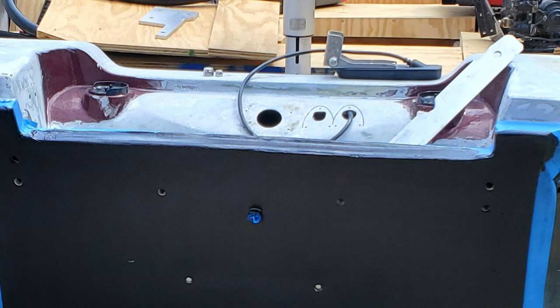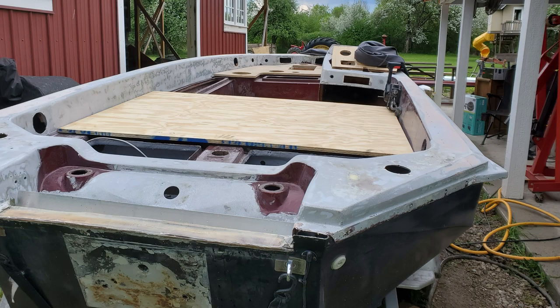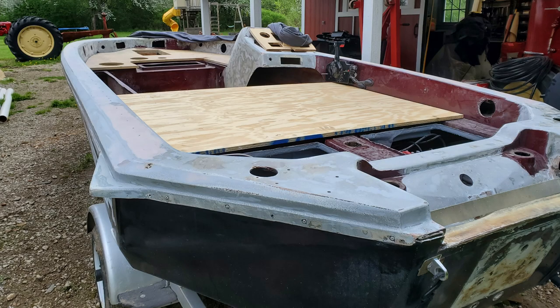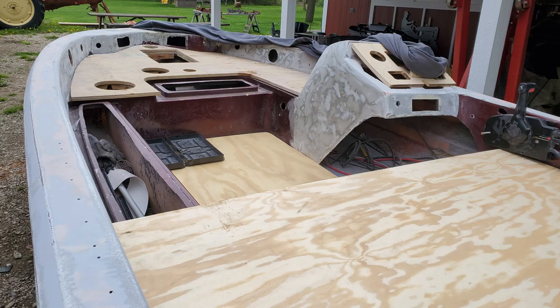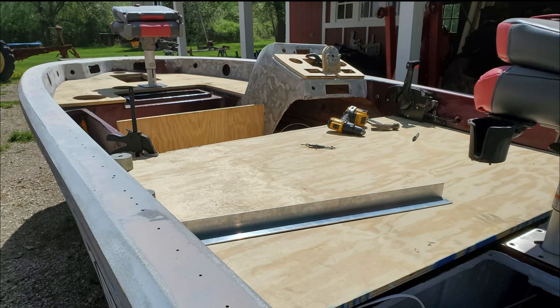I thought about converting those fill caps into bilge vents, but then I just decided to paint them and leave them in place. After lots of scraping and sanding, the topside was starting to clean up and I could continue progress with rough carpentry on the aft casting deck. A lot of old fiberglass boats had some pretty unorthodox hull layouts, and this one was a good example. The floor plan is disjointed and broken up into a series of poorly placed compartments, many of which are too oddly shaped to serve a useful function — the rod locker, for example, isn't even long enough to store a fishing pole. So I chose to build up a large continuous platform with expanded storage in what was just open floor space before.